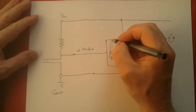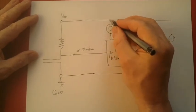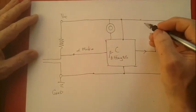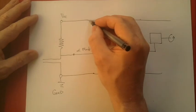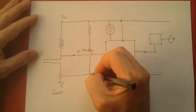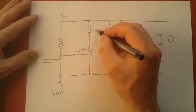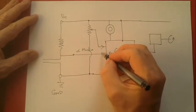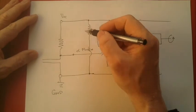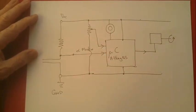There's another output which is a piezo crystal which makes a noise. And there's another input which is a potentiometer, which allows us to set the moisture level that we want to trigger on. So what the microcontroller is really doing is comparing the voltage on the soil sensor with the voltage that you set on the potentiometer, and deciding whether or not to turn the tap on.